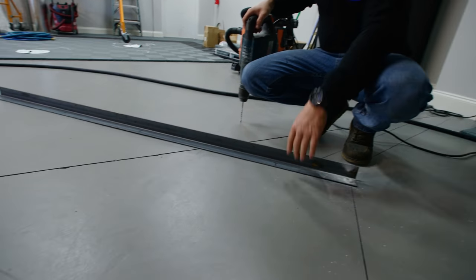So I'll be putting rebar in. Probably, I might have to compact the soil, we'll see. I'm gonna only cut away, I'm not gonna add fill, so you don't really need to compact unless you're adding fill. And I'm gonna try not to overcut so I don't have to add anything. So next video, we'll be showing prepping for concrete pouring. So yeah, it's coming along.